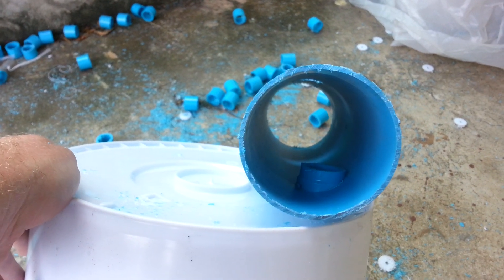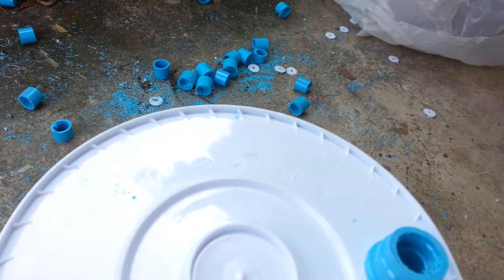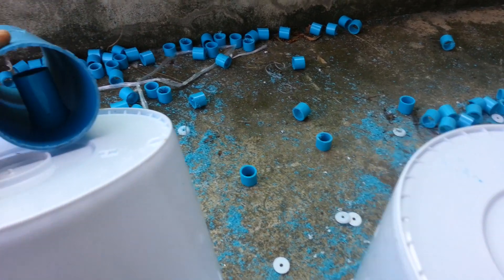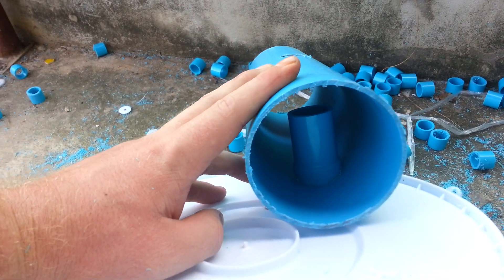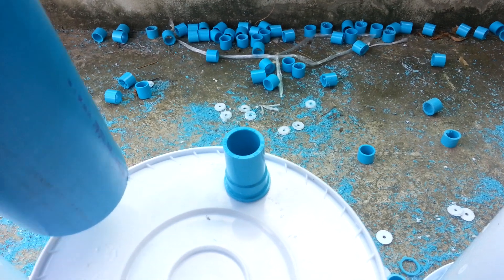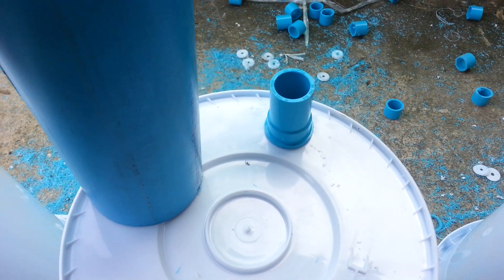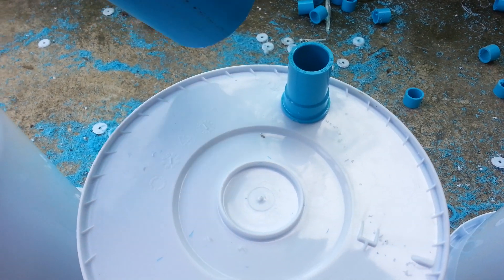See that one sits just inside there. Whereas if I didn't cut them, you can see how much room — and if you multiply that times 90 buckets, how much volume of the drain pipe would be occupied by that fitting. It's just unnecessary. I just felt better going ahead and taking the extra time to alleviate any drainage problems that could come up from having so much volume in the drain line being occupied by the fitting.